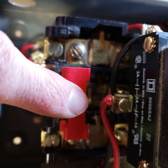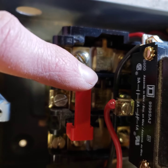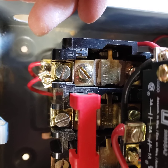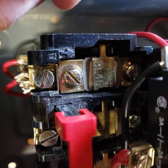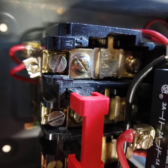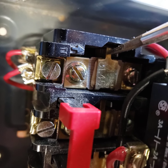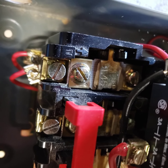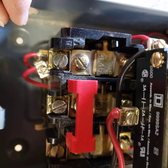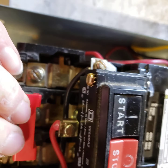This is a reset button. I don't quite understand why they had an external reset button, because I thought this was just a thermal fuse that would reset automatically. From my understanding, there's a solder element inside — you can see a little cog there. When that solder melts, somehow the cog spins, there's a little arm here, and if that trips, the arm raises off and it shuts off. Then you'd have to replace the element and reset it.